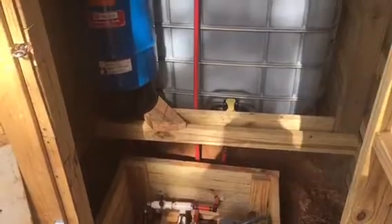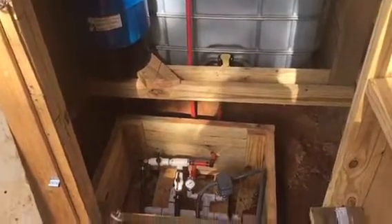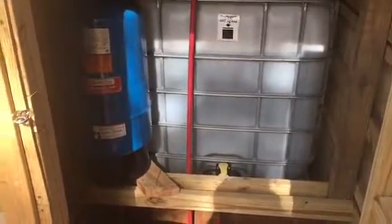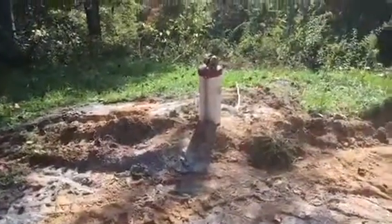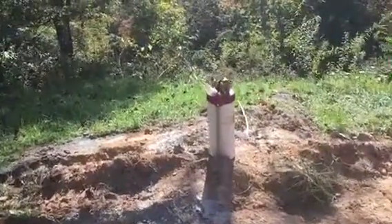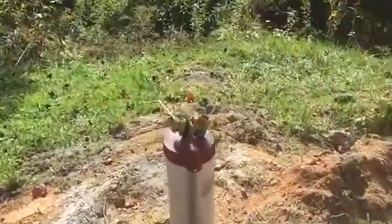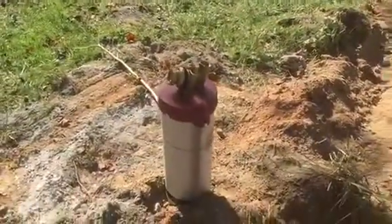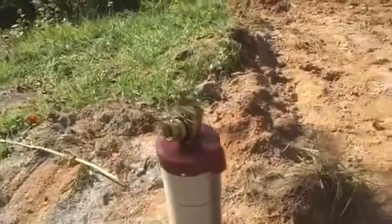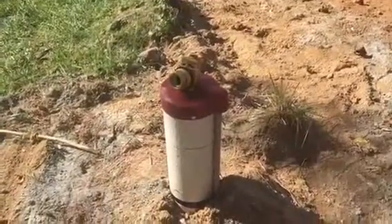We're here on this site. This is the site of a well that we've just got done putting in. This is a gravity-flow water system for right now. They're working out of their camping trailer about 200 feet below this site. They have a well. Another contractor went ahead and put in all the roads. We have this real neat six-inch well. What we have done here is we have a 220-volt pump down this thing. We'll also put a solar-powered pump on it. And what we have sitting on top of this well cap right here is what they call a pitless adapter.